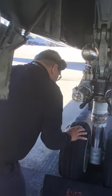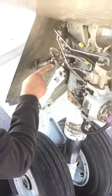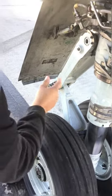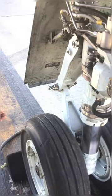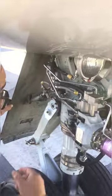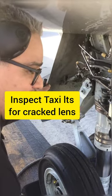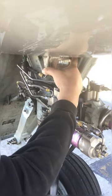On your nose torques, you have sensors here for your nose landing gear on both sides — make sure they're clean. You've got your torque link for your scissor links — make sure that's secure. We normally don't take them apart, but some stations do depending on their tow equipment. You're looking at the linkage and any kind of hydraulic leaks or liquid. Up here, check your light — make sure it's not cracked. On overnight we'll do an operational check on the lights, but right now I'm just concerned it's not cracked and it's secure.